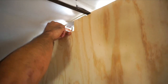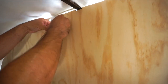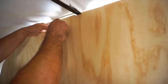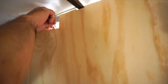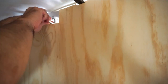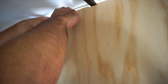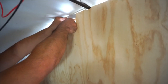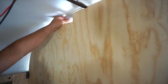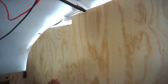It also allows us, if we ever need to make an adjustment to the pocket door, to have an access spot to get to the back and adjust it. This wall in the bathroom will eventually be covered with planks, so all we'd have to do is pop a plank off right there and we can get in to make any adjustments. That was one extra step — and we'll have to do that for the other pocket door's back side as well.